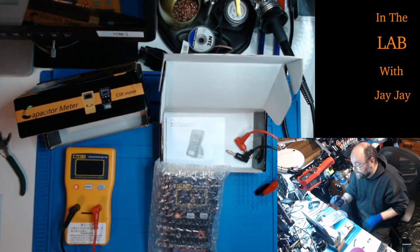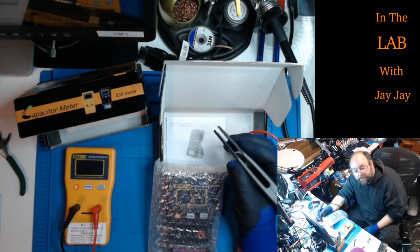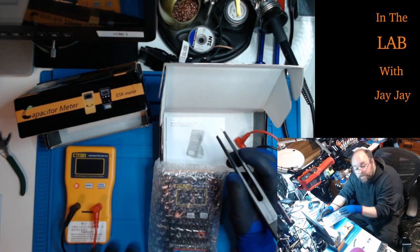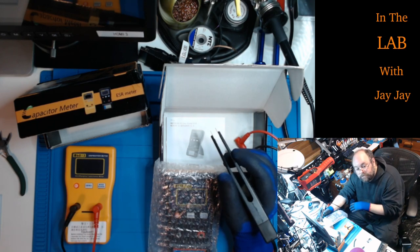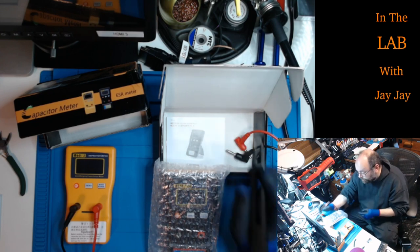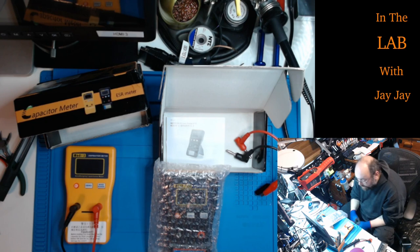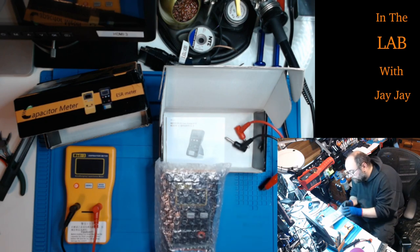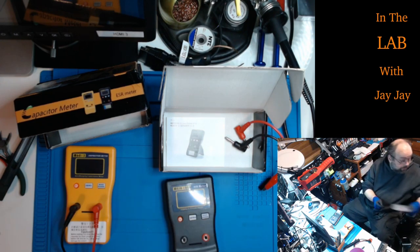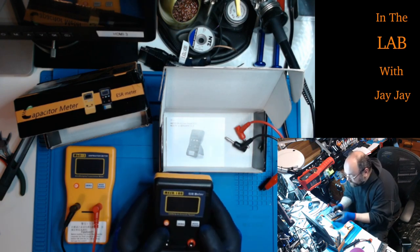Because that's what I want to do, is in-circuit testing. And my plan is to do a whole bunch of in-circuit testing of capacitance on the one hand and ESR on the other in-circuit. And then after I finish the in-circuit testing, I'm going to bust them all out of the motherboard and test them again out of circuit and just see what the various readings are. Because I'd like to know that I could get accurate in-circuit measurements. Means I don't need to remove the capacitor every time in order to get a measurement. So I don't want to go replacing capacitors that don't need to be replaced.